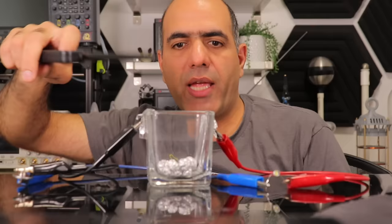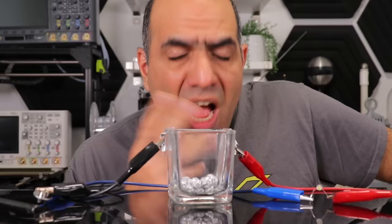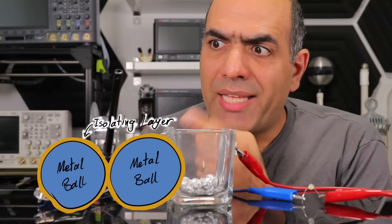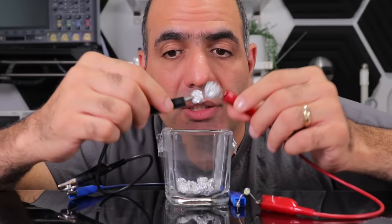They disconnect from the air vibrations from my sound, so I have to return to the cup coherer because it's much more stable and less sensitive to sound and vibration. Here's my theory — Wikipedia just says metal balls or particles cling together under high voltage, but what does that even mean? I say all these balls that are barely touching but not making an electrical connection must have a super thin — like nanometer-thin — layer of metal oxide between them that is isolating them electrically, although they are actually touching. The electromagnetic radiation from the tiny arc must be inducing a high enough pulse of voltage across the balls that breaks through that super thin isolating layer, connecting the metals. And if you push two balls together hard enough, you break that super thin layer and make a connection.